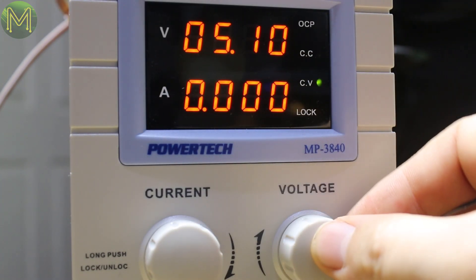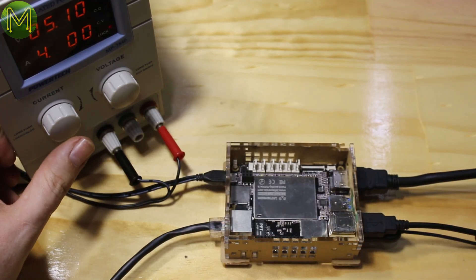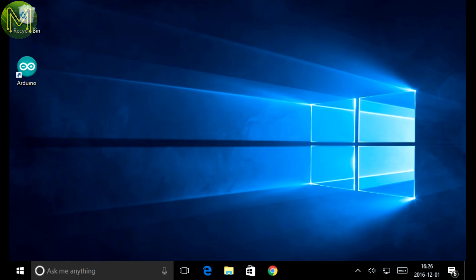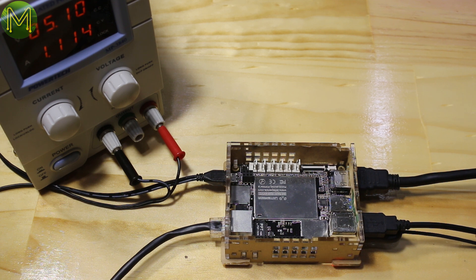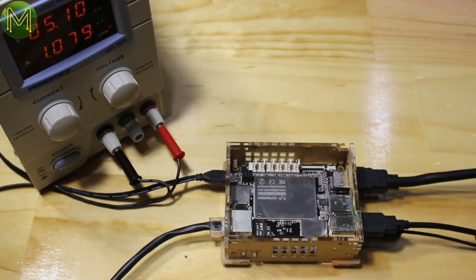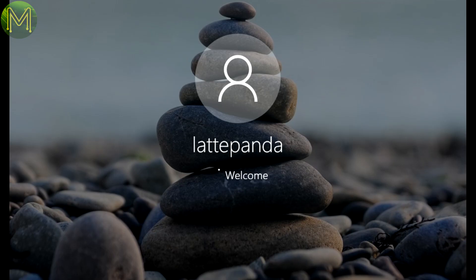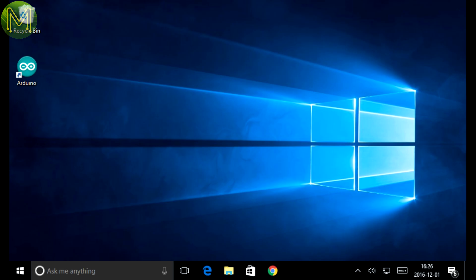My bench power supply is capable of adjusting the maximum current, so I set it to 4 amps as a start and booted it up. The peak current that displayed was around 1.2 amps, but it's not a real indication of peak current, so I wound it down to 3 amps and rebooted, which came up with around the same peak current. So what about 2 amps? Well, it booted, but can't really say if it would get any further, especially if you load the USB bus down.